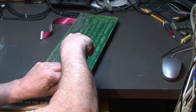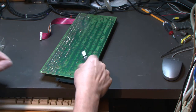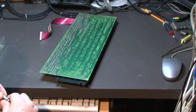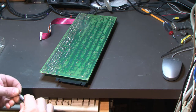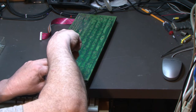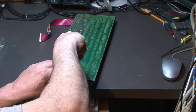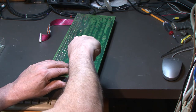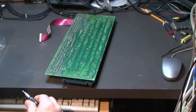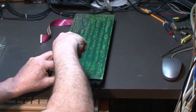Be really careful with these screws, they're just going into plastic. Overtighten them, you'll strip it out. You could probably move all those keys, have a screw thread in them. So, I guess if you strip one out, you could take the housing and move the housing over. It'd be a little bit of a pain, but it could be done.